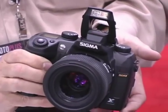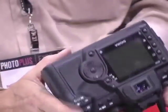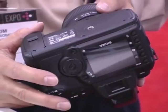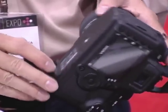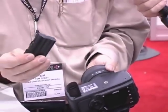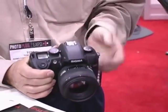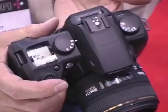Are there any other new features, like the battery? Yes, the power supply has been revised. In the past we used conventional CR-V3 lithium batteries or AA-size rechargeable batteries. We now feel it's more advantageous to use a proprietary rechargeable lithium-ion battery system. It's a simple module that charges in about an hour and a half to two hours, and provides enough power for about 400 to 500 pictures, depending on how much focusing, flash, or monitor viewing is used.